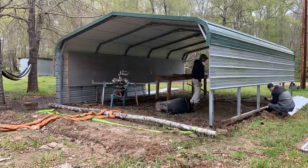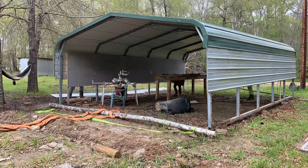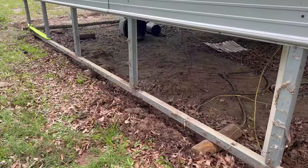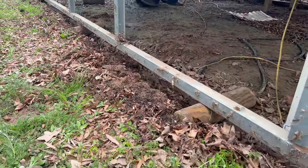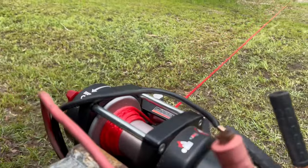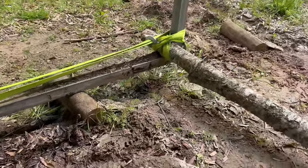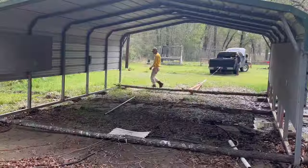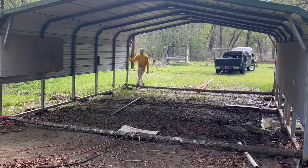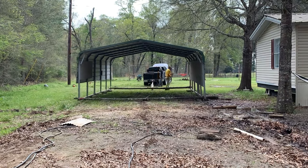After removing the bottom panels to help avoid any damage during this process, we used a large pipe and a log to create leverage and raise the carport off the ground. The plan is to use these beams to roll the carport about 200 yards to its final destination. We decided to go with a winch mounted to the hitch rather than just pulling this carport with the truck. This gives us much more control and helps prevent any damage or getting stuck in the mud. As the carport began to move, we slowly watched for any pinch points or movements, then moved the back rollers to the front and repeated this process throughout the entire move.